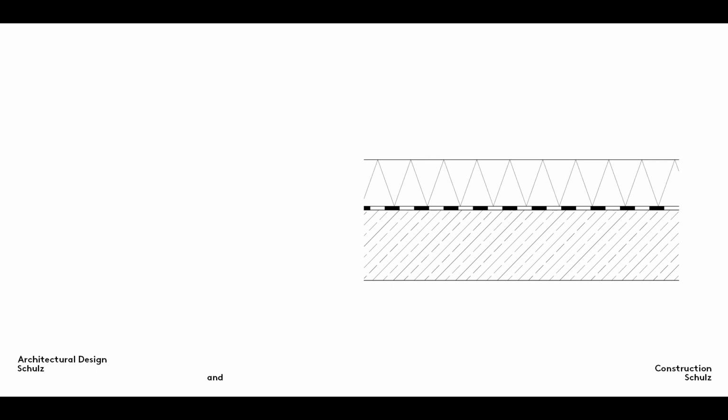Insulation is then laid on this vapor retarder, as for a warm roof. In this case, the insulating material used is generally mineral wool laid in strips between the ceiling joists. The top of the insulation may be protected by sarking or another liner, as for a pitched roof.